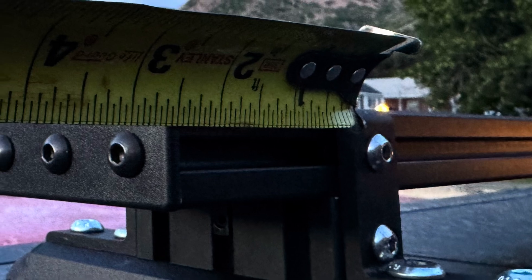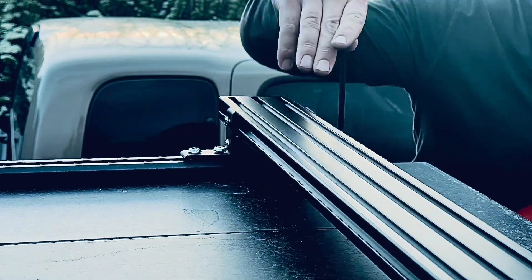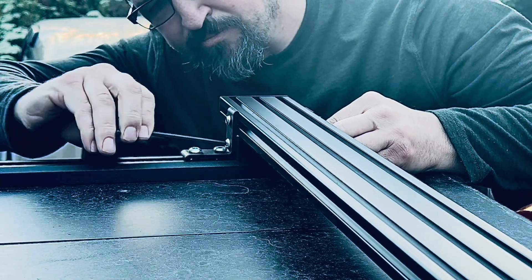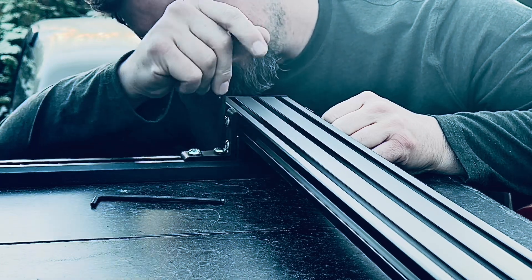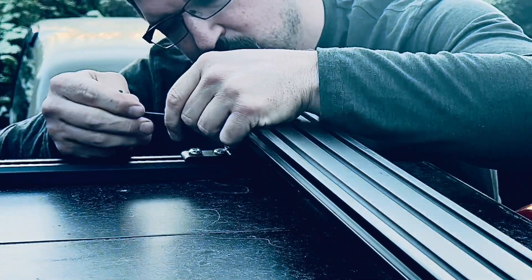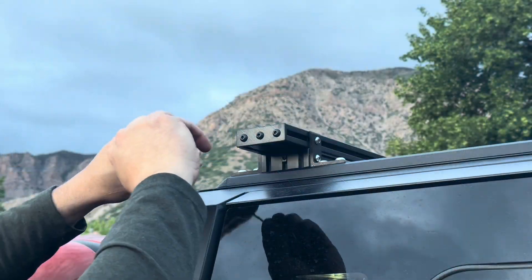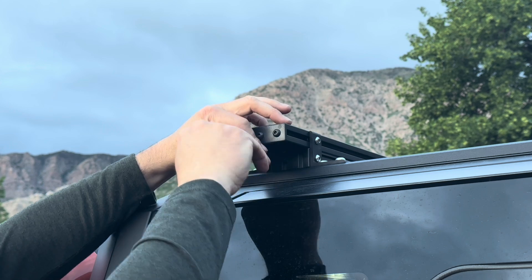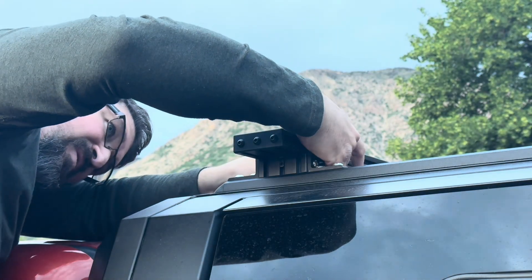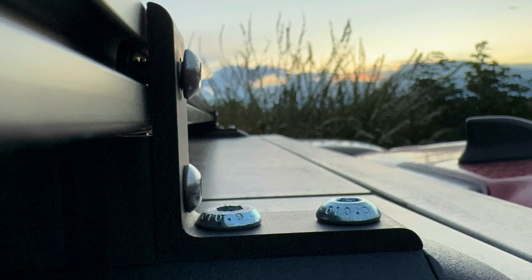Be sure to measure each side of the bar in order to make sure it is centered. After replacing the end cap on the rail, I slid the bracket to the edge of the rail and tightened up all the screws. I used the number 5 Allen for the M8 screws on the bottom mounting to the rail, and the number 4 Allen wrench to tighten up the quarter 20 screws on the sides. Next, I used the 2.5 Allen wrench to tighten up the set screws in the hidden brackets. This was a bit difficult to do with the bar mounted on top of the cap, so after getting the feet in place, I took it off of the cap carefully, tightened the screws, and put it back on top of the cap.